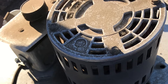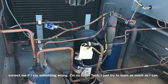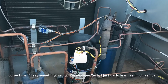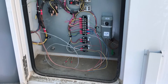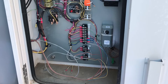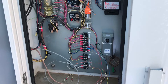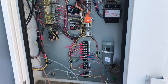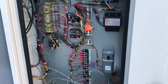A little bit about the sequence of operations on this Addison outside air unit — I don't know everything but I try to read as much as I can. This unit has an outdoor thermostat set at 60 degrees. So whenever the temperature is above 60 degrees, it will energize your compressor contactor, your outdoor fan motor, the liquid line solenoid, and your hot gas bypass solenoid. The indoor blower motor is continuous operation — it's always bringing in outside air.